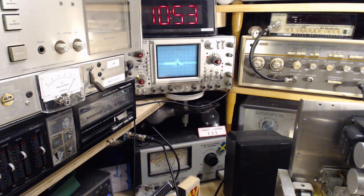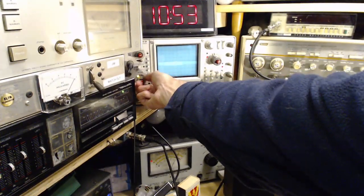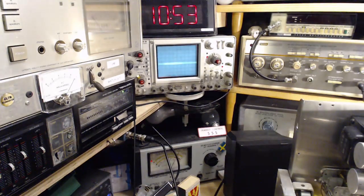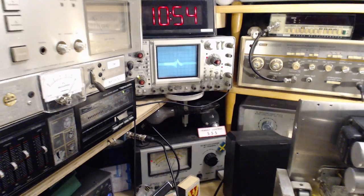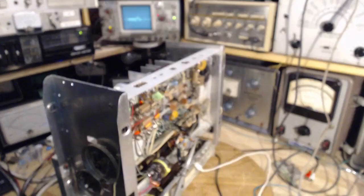Change the scope lead to, yeah, it's just not enough left. That's times 10 now. It's just not enough signal to really show up. Times 1 doesn't seem to affect the radio operation. Well, I'm still not in a position to go ahead here with alignment, because I'm still not getting exactly the kinds of things we need to see.